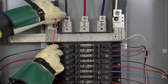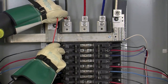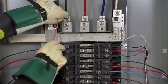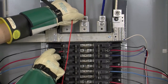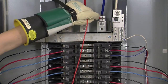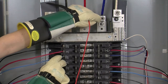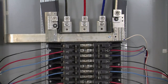If we have 0 volts difference, we know that the top pole is phase A. If it was any other phase, we would have a voltage difference — in a panel like this, it would be roughly 208 volts. Here we have 0 volts difference, so we know that the top pole here is phase A. Moving on to phase B: here we have 208 volts difference, here we have 0 volts difference, and here we have 208 — so the second pole down is phase B. Moving on to phase C: here we have 208 volts difference, here we have 208, and here we have 0 volts difference — so the third pole down is phase C. We're going to want to repeat this phase test for every line that we have CTs installed on, and once all phasing is identified, we can go ahead and install our CTs.